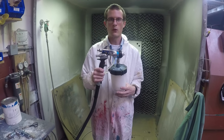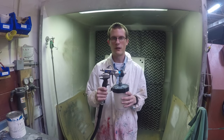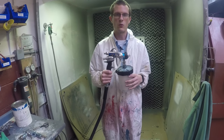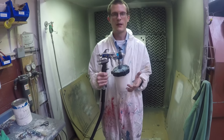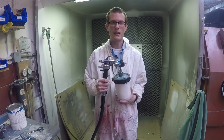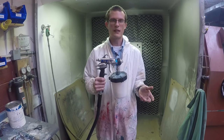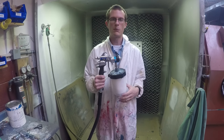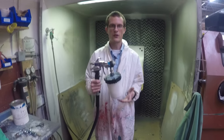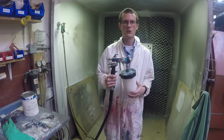When you're looking at a turbine gun, one of the main benefits is its portability. It can be dragged with you in the field. It can spray light to medium viscosity paint and in general is very good for field work. If you're in a shop all the time and have a compressor, then you may want to consider a compressed air gun. If you're looking to just get into painting and don't want to purchase a compressor or tie up shop space, then a turbine can make sense for occasional projects or even light to medium use.